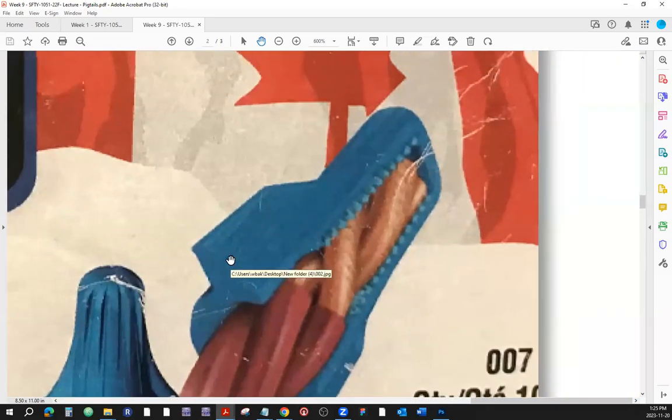aside from pre-twisting or not pre-twisting, some of the boxes will say no pre-twisting necessary. Here's what I have a problem with: if you have more than three wires and you don't pre-twist them, there's a chance that there's going to be one wire in the middle just being held by the other wires that surround it. And that's the only hold it's going to have against the whole system. It's not going to make contact with the thread. And what happens when that happens? Well, just think about it.